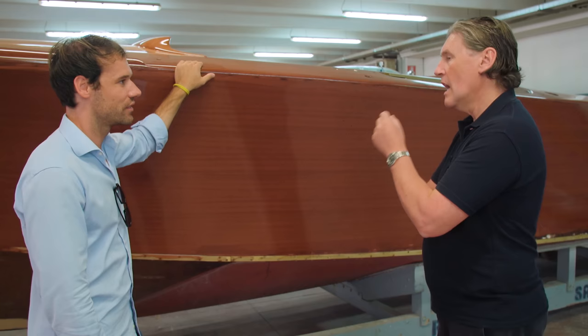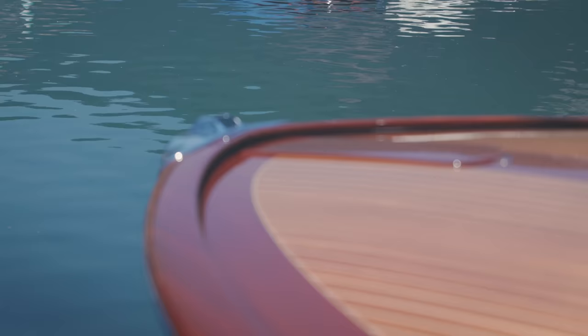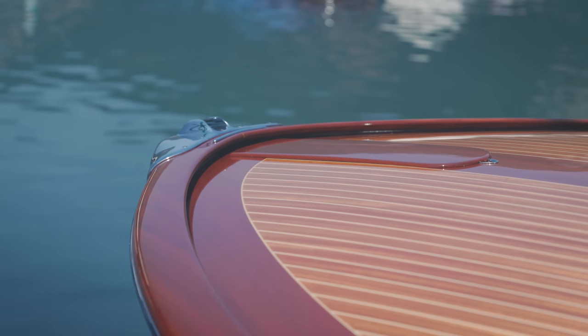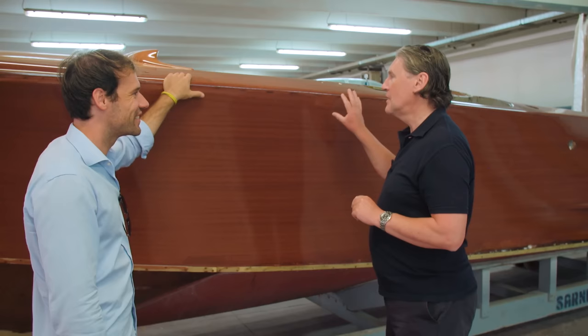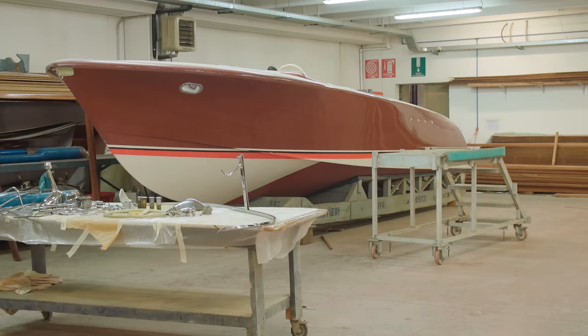And how thick does that become? What is the sort of thickness? Not a lot, actually, because the wood absorbs most of that. In fact, after 2 years, it is generally suggested to put on another cycle of 5 layers, because after 2 years the wood absorbs it. Incredible. And does it make the wood stronger, absorbing the varnish? The process just slowly carries on. It's a whole science, isn't it?